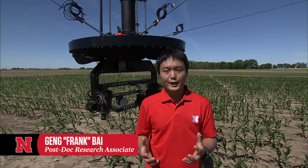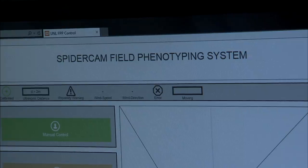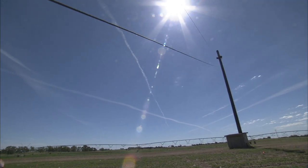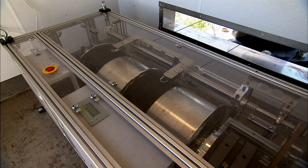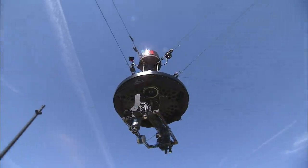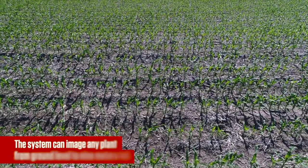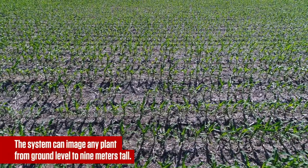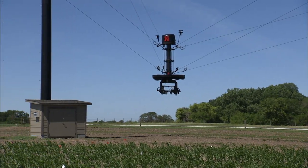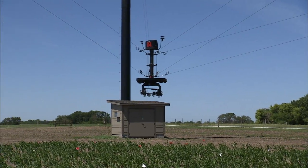With this system we can see what people cannot see by their naked eyes — we can do very accurate measurement and very fast. The system requires four different poles; the tensioning on the cables has to be adjusted based on where it's out in the field, and so it shortens and lengthens each one of those cables specifically to get to a specific location. We can do any crop we want because we can raise from one level to nine meters above the ground, and we can control within about plus or minus a centimeter of placing that camera in the same position each time.